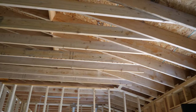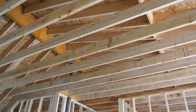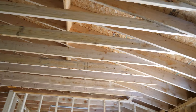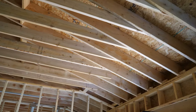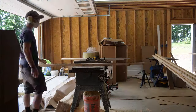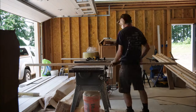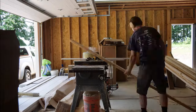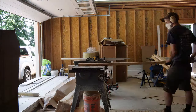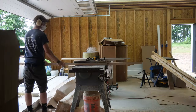This is one small consequence of using dimensional lumber and a structural ridge rather than an energy-heeled truss — the available room for insulation is a little bit less and we have to make some accommodations on the back end. But there was no real other way to frame a house like this; the structural ridge was the safest way to go. We could have used I-joists to give us more ceiling depth in the cathedral ceiling, but that would have literally broken the bank. Fun fact: our I-joist floor system was the single most expensive framing line item, with the joists alone coming in at nearly $6,000. Adding a spacer to the underside of the rafters was a much more economical solution — I'm actually using scrap 2x4s that were too bowed and twisted for walls, ripping them down on the table saw.